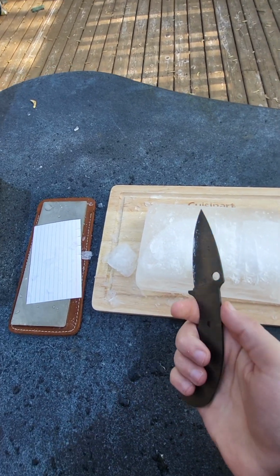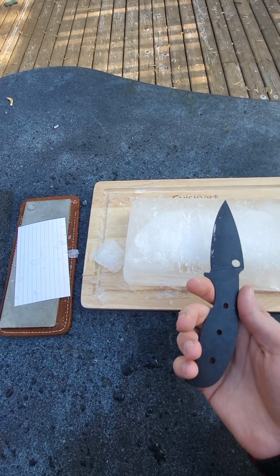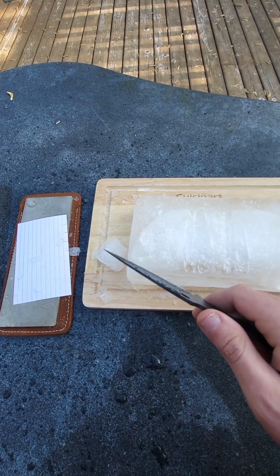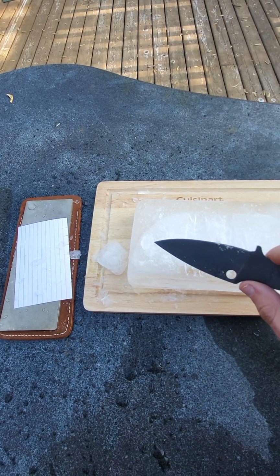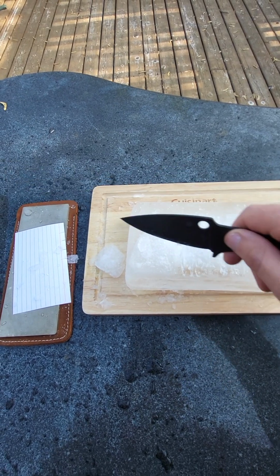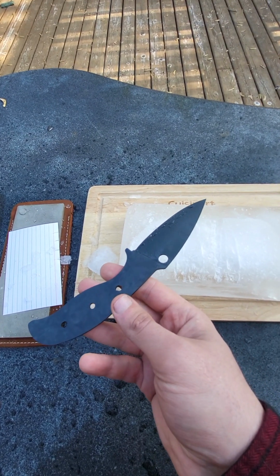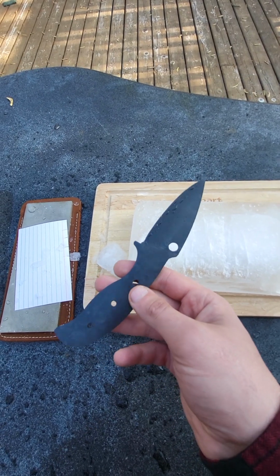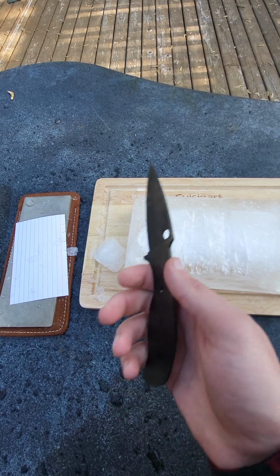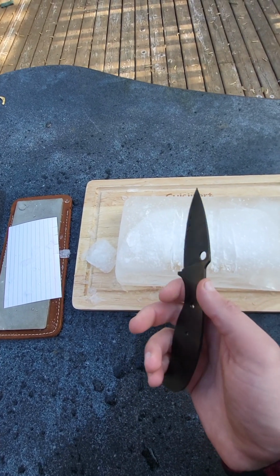Now, what I normally do is I always implement ice block testing to put two different dulling mechanisms, draw cutting on the sanding roll and chopping, to make double blunting mechanisms to actually articulate on the edge. Abrasive wear and then impact wear, to me, I think gives a good balance of what the steel can actually do.